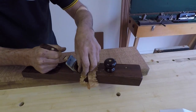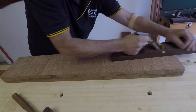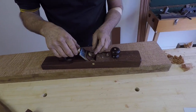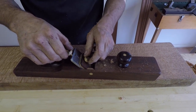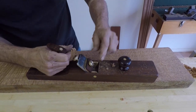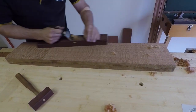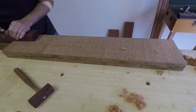That's cutting pretty nicely on this piece of silky oak. Work your way across the board — there's probably still a couple of little highs and lows in the steel. If you want to do a further adjustment, say we want to go a little bit finer, always for any adjustment back the lever cap bolt off and then do your fine adjustment. A tenth of a turn will change the depth by about 1/1000th of an inch. As you can see now we're into a very fine shaving. But for final finishing of certain pieces of wood, a really fine shaving like this can give you a really good result.